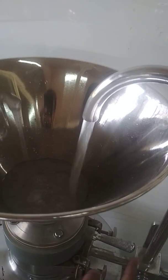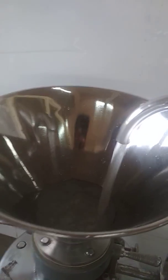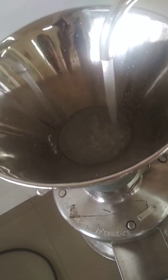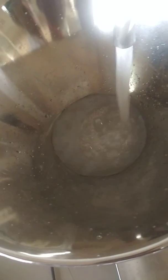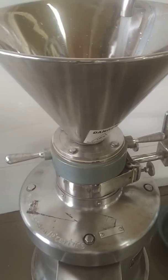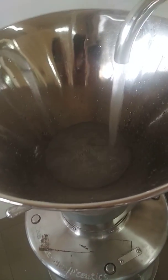The dispersion flows down ahead to the rotor. During the movement of the rotor at 3,000 to 20,000 revolutions per minute, the centrifugal force throws a part of the dispersion onto the stator. Depending on the clearance, the dispersion is sheared between the rotor and stator. Thus, size reduction can be achieved.